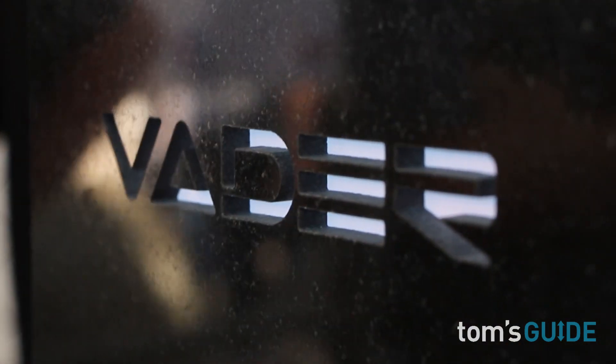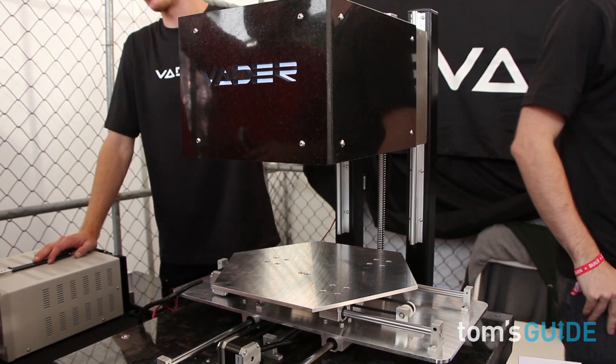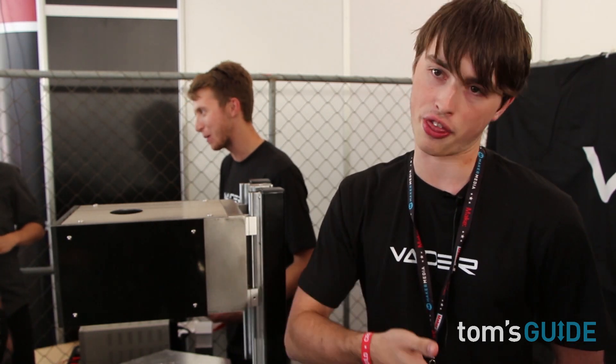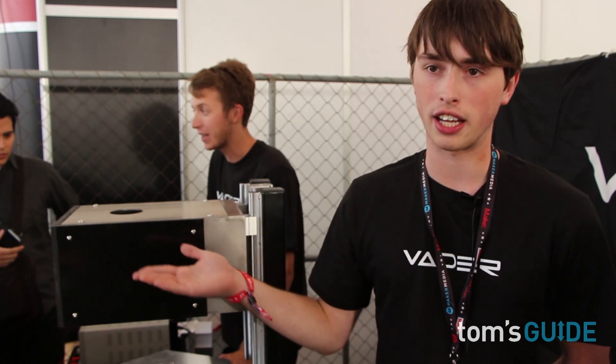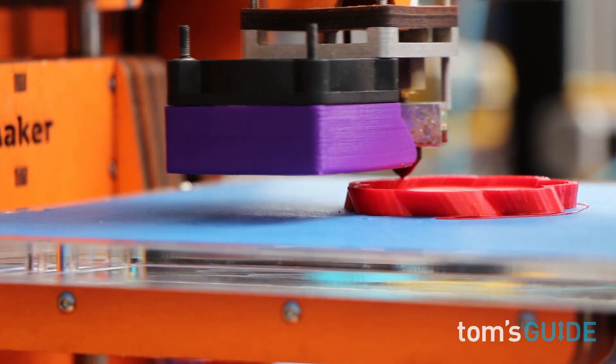Roughly, we're using magnetohydrodynamics — magnetic propulsion of liquid metal through electromagnetics. It works more similarly to an inkjet, in that we do high-speed droplet formation in the range of 1,000 Hz to 10,000 Hz — that's 1,000 to 10,000 times a second — just like an inkjet does, versus FDM plastic printers where they lay down a continuous bead or strip of plastic.